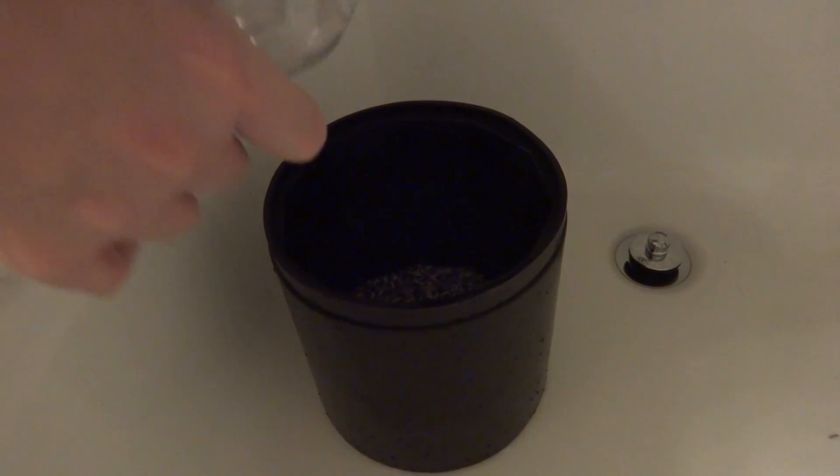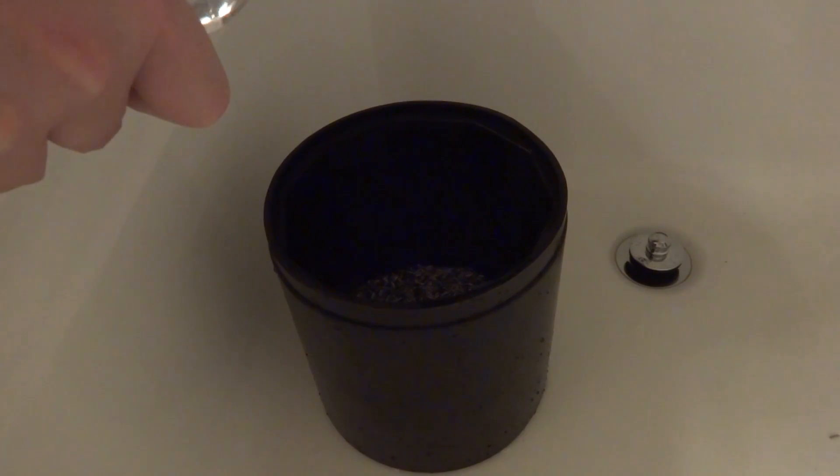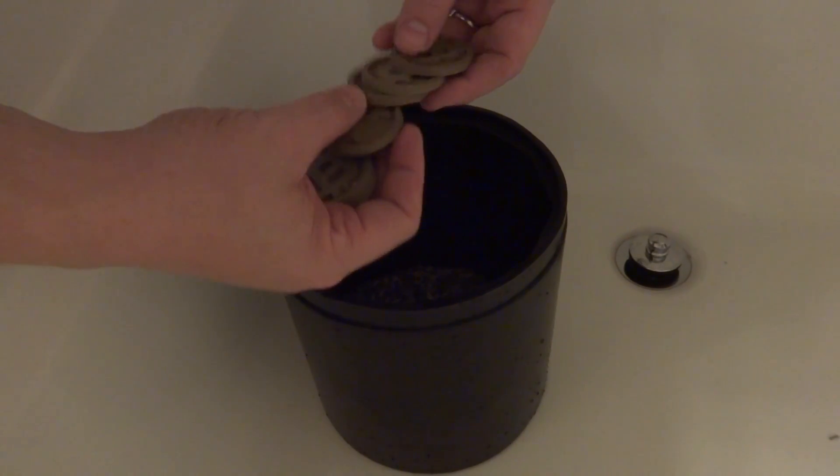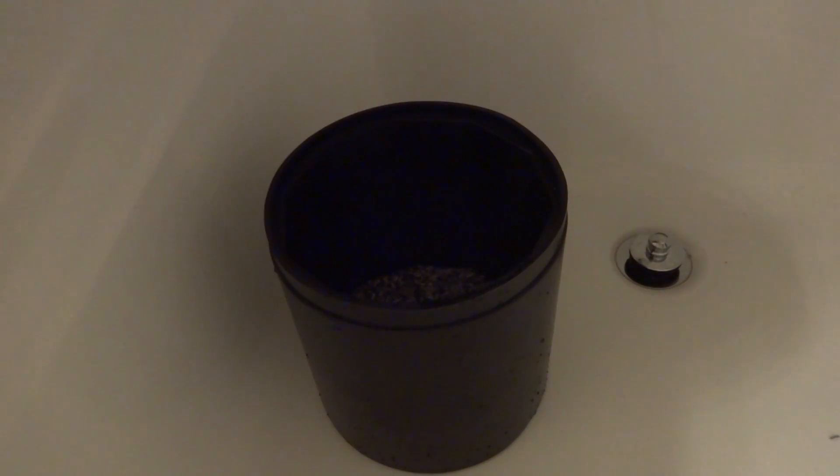I rinsed the steel stuff and I'm going to add another bag into the pool. Now we've got double the material — 10 pounds of steel in there. Because I like tinkering, I'm going to try putting less water in since I think I did too much last time — it was actually above the pins. I'm going to meter it using this cup. Now there's water in there but it's not completely covering everything, and last but not least just one drop — not a squirt, a drop of soap. I took one of the seven coins out as another reference point, then dropped them all in.